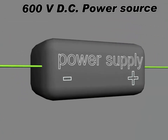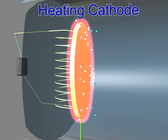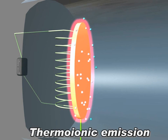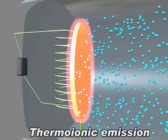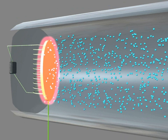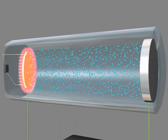They are connected to a high voltage DC supply, about 600 volts. If the cathode is heated, electrons of the metal atoms are excited and move a little away from their nuclei and immediately go back. So when the DC supply is switched on, the negative electrons are repelled from the negative cathode and attracted to the positive anode, flying in vacuum with no wires. This is how we can get a beam of electrons in vacuum.